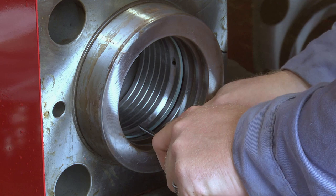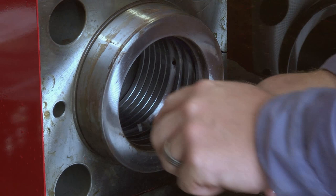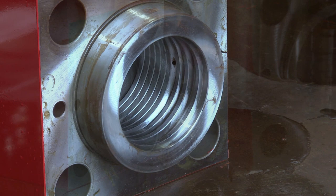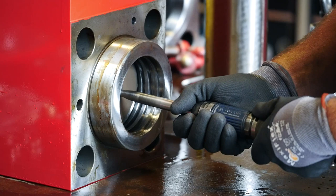There is a third seal in the bottom of your cylinder — it is the very upper seal that is basically a wiper. It is a two-piece seal but it can only go back in one way. Once you have removed your seals, inspect your cylinder for damage. If there is any scarring or scratches inside the cylinder walls, they can easily be polished with the correct tools.